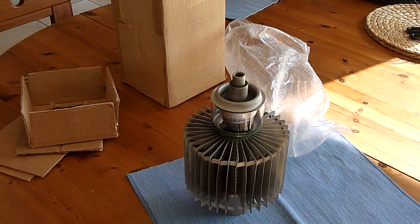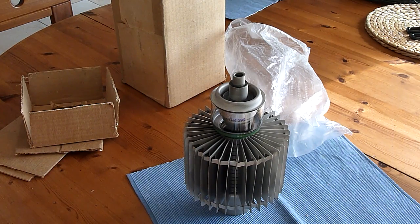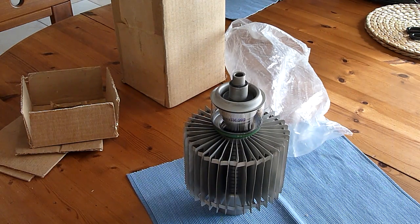This is the GU-56. You might think this is a GU-56B — it is not. The B and A on GU tubes stands for: B is forced air-cooled, A is forced water-cooled or just water-cooled, and there's also a V which stands for vapor-cooled. This tube is ambient air or convection-cooled, meaning I do not have to direct a fan on it. It's cooled by convection — the heat sink gets hot, air rises, and that cools the heat sink.